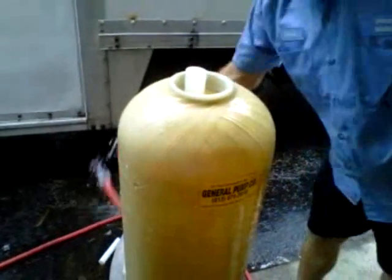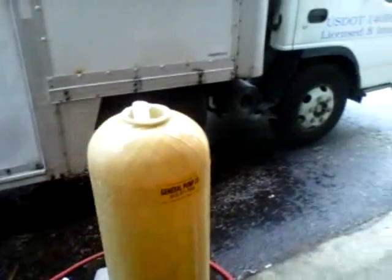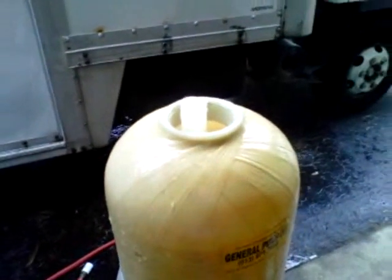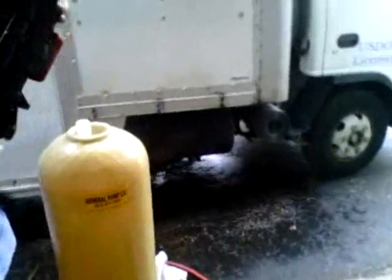New resin will have to be backwashed thoroughly and then rinsed because it'll have color and a bad taste. That'll pass quickly.